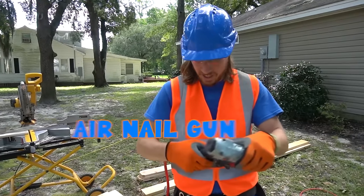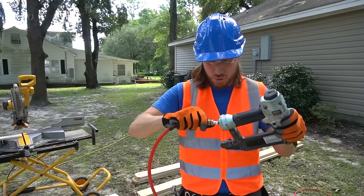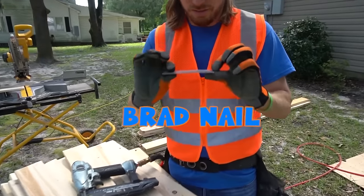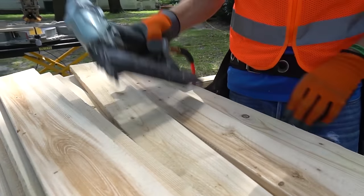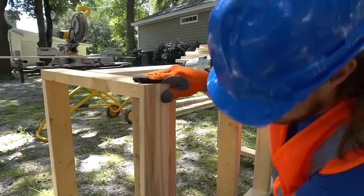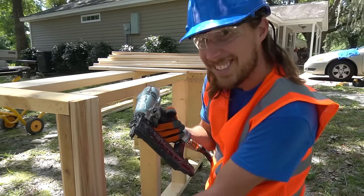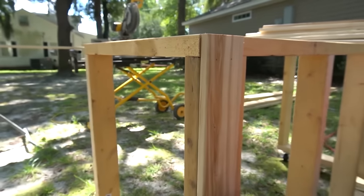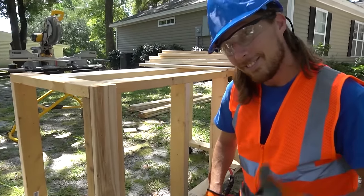So what it is, we put nails in here, and this awesome red hose is connected to what we call a compressor. It's loads and loads of air pressure that shoots right into that gun and shoots the nail out really, really fast. This is what you call a brad nail — those are really teeny tiny nails. Let's take one of our boards and start right here on the left side. Sit it right on top just like that, line it up nice and straight. Push on that gun and pull the trigger — just like that, it shoots that nail all the way in there. We're going to space out some nails, top and bottom. Let's get the rest of these on.